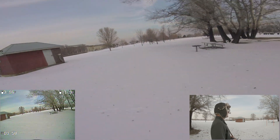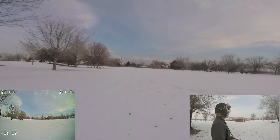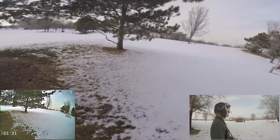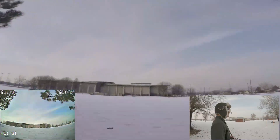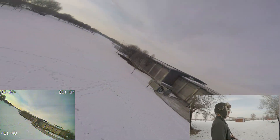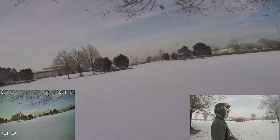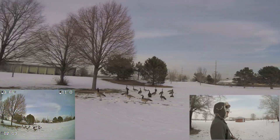We're off — let's see what we find down there. We've got some lovely trees, and looks like we have some of my other flying friends. They're well accustomed to me. I typically leave the geese alone because I don't want to be a nuisance. So far pretty good — no lockouts, no trouble. I'm facing with the carbon fiber plate directly toward me right now, so this is the worst RSSI scenario, and I'm not having any issues. I'd say the antenna placement is definitely good enough. If I ever needed more range I could make adjustments.